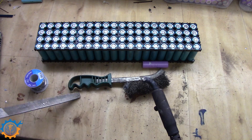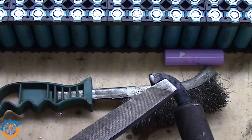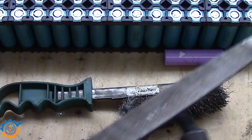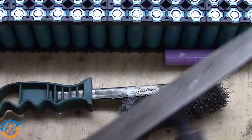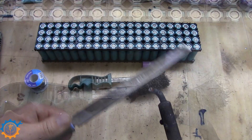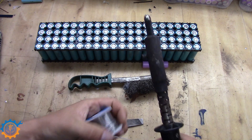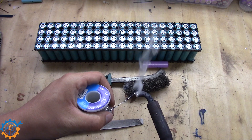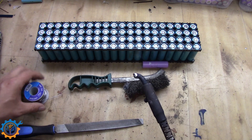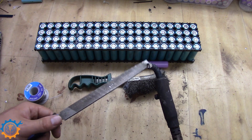If on the other hand you have a copper tip like I have here, you will see that the tip wears very fast, and you need to clean it up with this tool every now and then. This will wear out the tip quickly, so as soon as you've cleaned it up and improved the tip a little bit, do not forget to wet it again with the solder. As I said, do not file down tips that are newly bought.